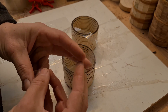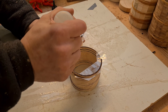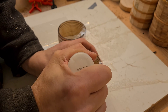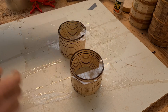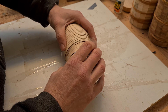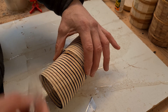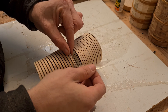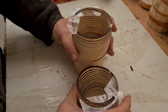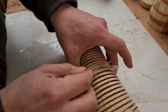Exact reproductions require a lot of patience. With these spirals, I left the ends as long tapers, which I could then glue two of them together and have a near seamless joint in the same thickness as the rest of the spiral. I used packing tape to ensure the CA glue did not spread further than the taper area, and then an accelerator to finish the job quickly. On reflection, it may have been better to have a square cut rather than a taper joint — with a smaller gluing area it may not have been as strong, but certainly would have been neater and used less glue. The glue could have stiffened the long taper area, which may lead to diminished performance.